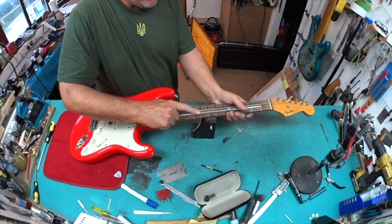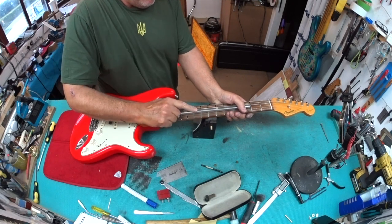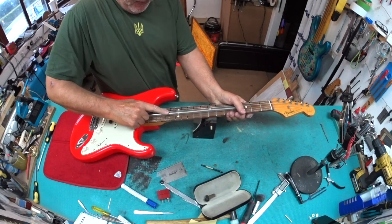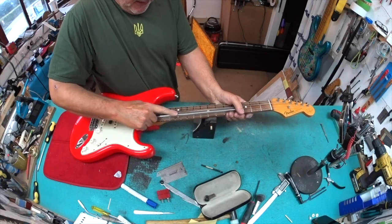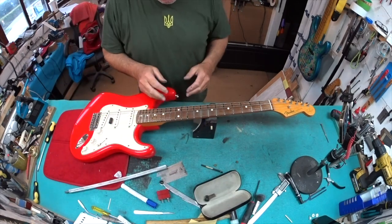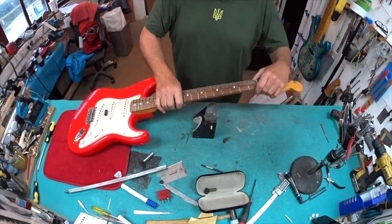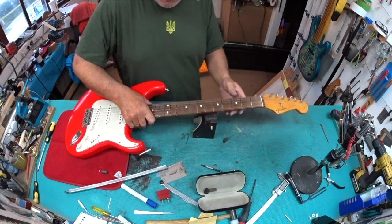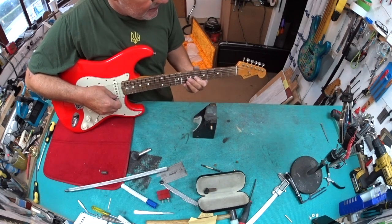Now here is the G track, and the G track is going to be critical now to getting those bends, because it's in the G track that the bends typically choke out. And so this point here, where there's the valley in the G track, is going to be significant. It's going to have an effect. Of course, the thing about low frets is that they dictate what you can do on the neck more than the high frets do, because a single high fret can be taken down quite easily.